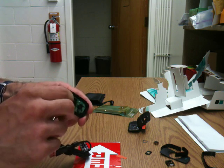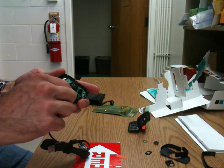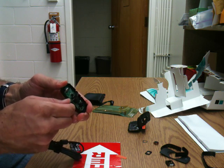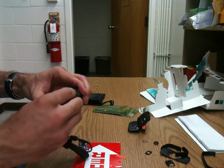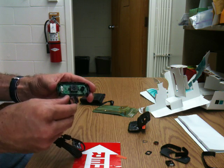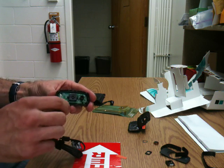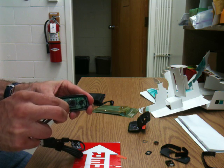The first thing I need to do is remove this little box — that's the lens enclosure. It's magnetically held on, actually a combination of magnets and some clips. So I've removed that cover, and now I have the lens. The lens is an autofocus lens, which means it's somewhat flexible — it can move back and forth, and you'll see it wiggles if you push on it.